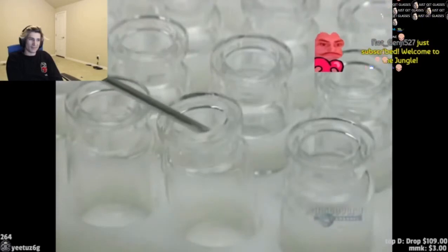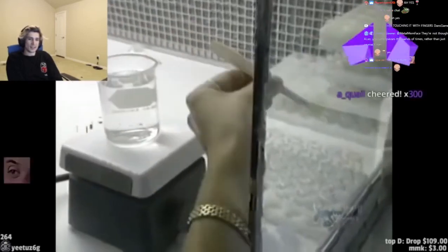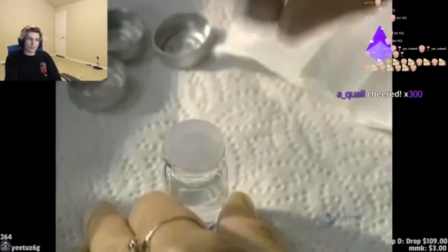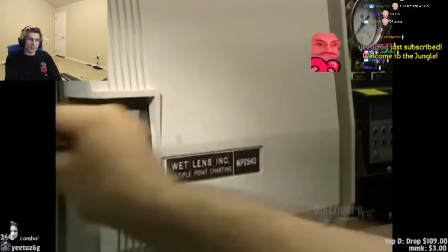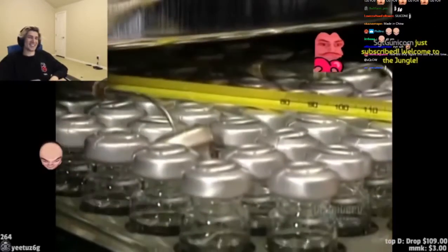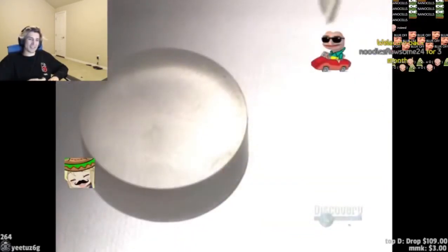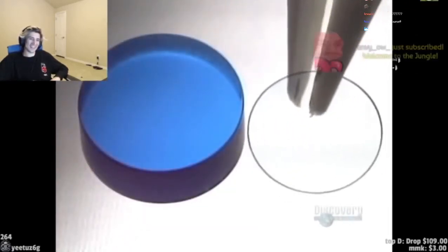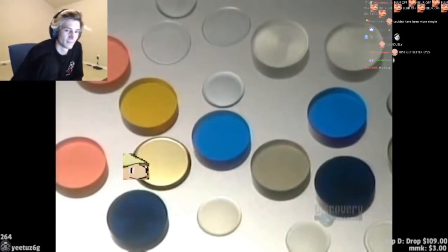Lenses are now completed and are cleaned, and they're stored in containers filled with a salt solution. This little vial that we find at optometrists is perfectly sealed with a silicone cap and another of aluminum. These vials are placed in a sterilizer at a temperature of 121 degrees centigrade for an hour and a half. The contents will remain sterile for a period of up to 7 years if not opened. The production of a lens involves 14 steps. If we exclude the rather lengthy hydration process, actual lens production requires only 15 minutes. They can produce almost 1,000 contact lenses per day, all made from these tiny colored discs.